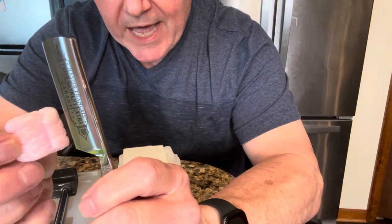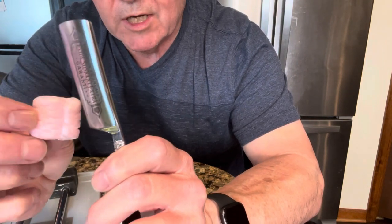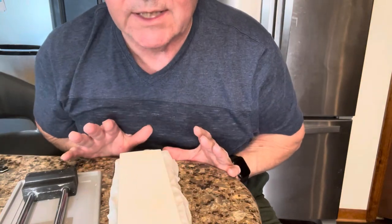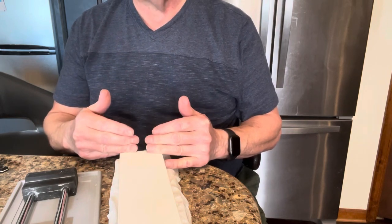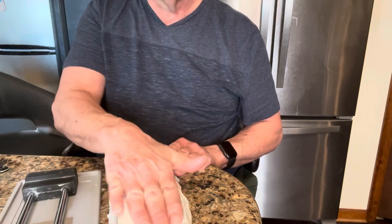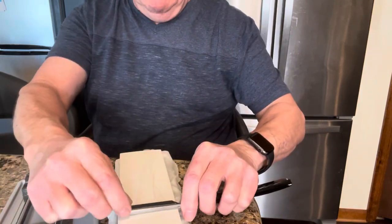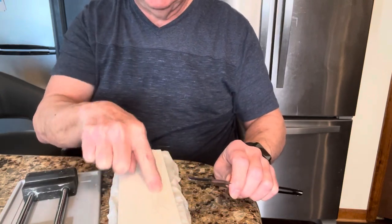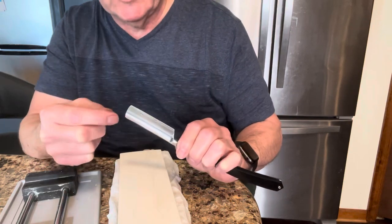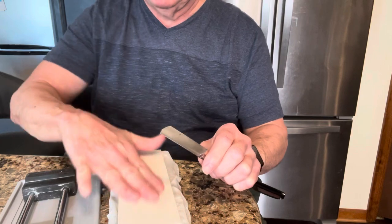Although that slurry could — this cracks a little bit as I'm touching it, it kind of goes in a little bit more to the toe than on the heel. So what I'm going to do is go on to the 20K. This is one thing on this style that I have found helps me out — sometimes going back and forth on the curvature dimensions is beneficial. So I'm going to go back and forth a couple of times. You could see a line in here — sometimes that line could be from some kick-up of something, since I'm usually using something a bit more coarse to back bevel. That could be a contact that will disappear pretty quickly.